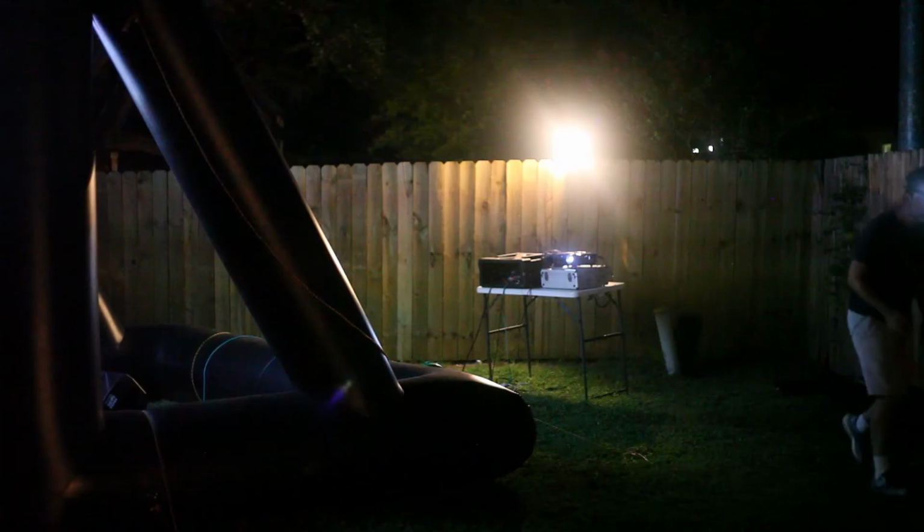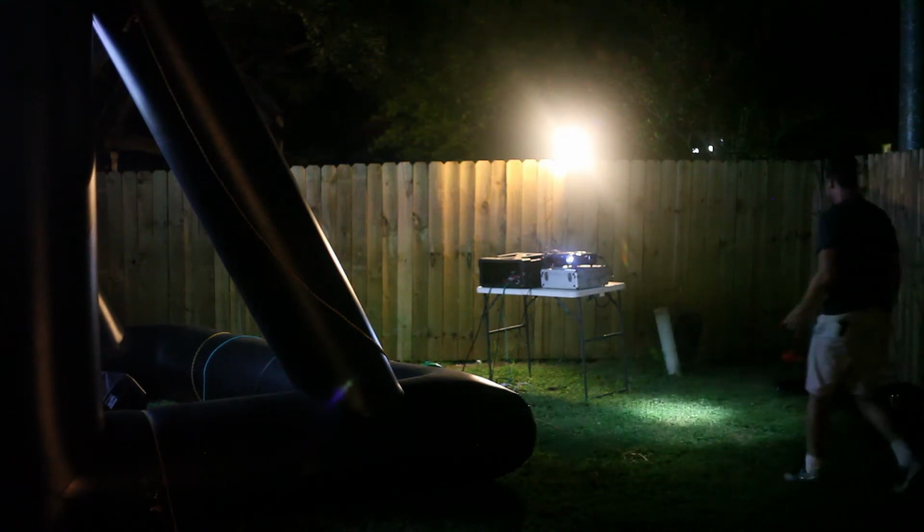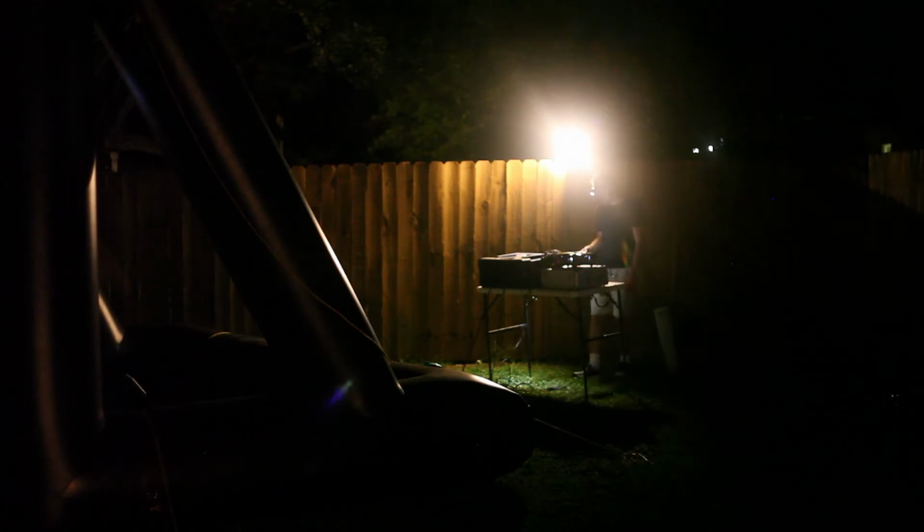And then once you start to see audio from the movie happening, you can fade out your iPod or your music playback device. On my iPod, I just go counterclockwise on the thumb wheel, and then I go clockwise on the main volume. That makes a nice transition. Typically, the Blu-ray audio or the DVD audio is mastered at a lower level than just CD or MP3 audio. It depends on what it is, but it's like a 12 dB difference, 12 to 20.